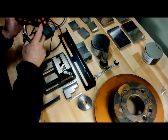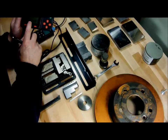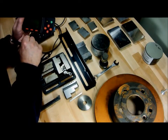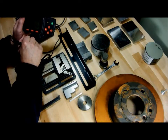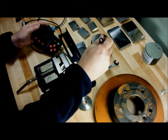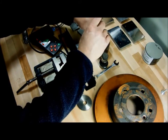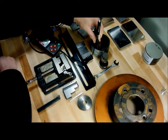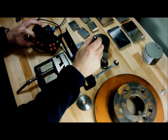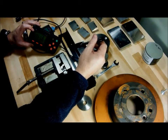So let's measure in HRC. It's showing zero right now as the Leeb value — this is the number that the device actually measures in, and then it's converted to HRC, Vickers, Brinell, whatever it might be. Let's do a quick test on the test block. You can see a value shown here of 41.6, Leeb value 652. Now we never do just one test because you'd have inaccuracies.